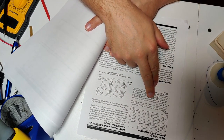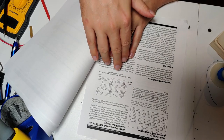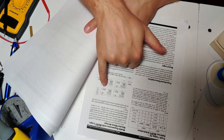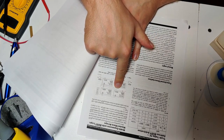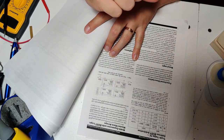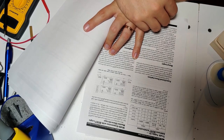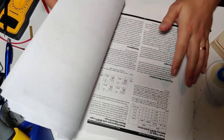Okay, so that's interesting. Apparently this is for cascading chips in parallel. So say you want to do 32 bits worth of data, which isn't us here. You cascade the busy signal from the slave into the parent, or rather the parent's busy signal drives the children. I'm not sure. The thing is, I don't need to be super sure because we're a master at all times. So that seems to make sense to me. So I'm just going to tie master to VCC and forget about it. And then I'm done for the day.